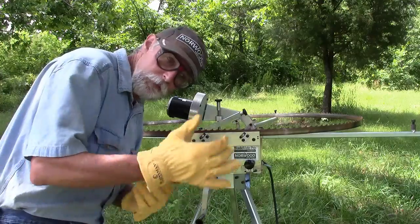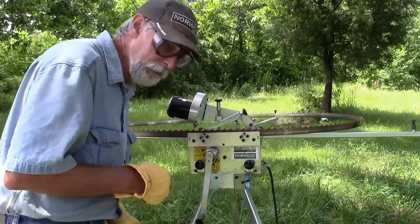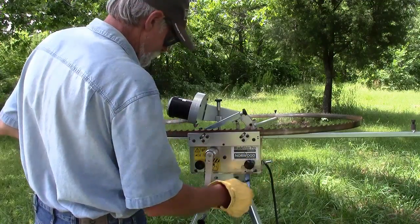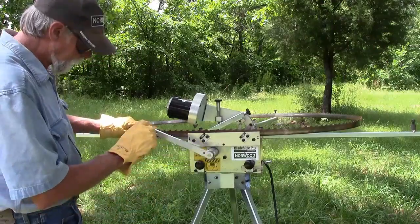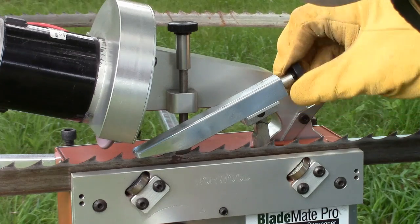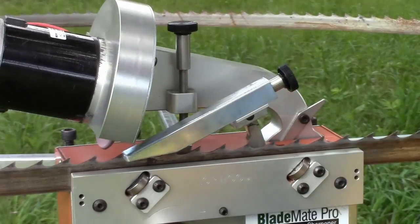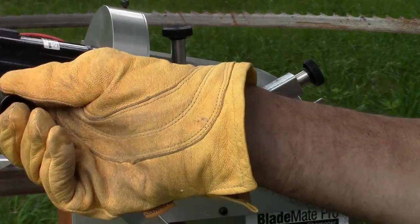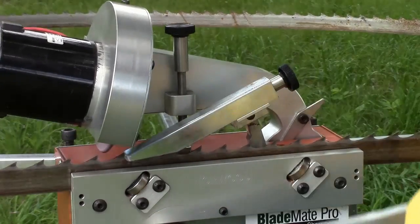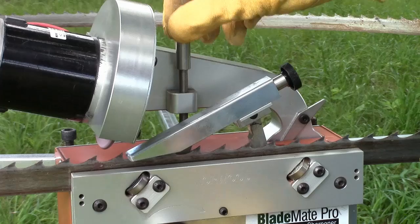The main thing is that you want to have safety gloves and safety glasses on, because it can throw sparks and small pieces of metal which could hit your face. We're going to turn it on and see how it's going. We're not getting anything yet, so the first thing we're going to do is back off the feed so it doesn't push quite as far. The first tooth won't have any effect — the next one is the one we're looking for. Just a bit — and that's really all the cutting we're looking for, just barely nicking it.